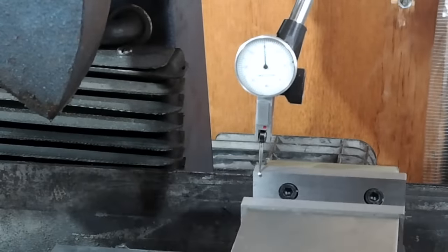I used a bit of junk aluminium — skip fodder — and while cutting it to length I also shortened the load lever. I very roughly cut clearance slots underneath it to clear the angled bed slides and prevent any damage. It's held in place using one 8mm bolt and an underplate. As you can see it wraps neatly around the front of the lathe head. After cutting another bit of aluminium bin waste and bending a bit of 8mm bar, I drilled and tapped various places to get the items to fit together, with the purpose of making the whole thing fully adjustable without interfering with any other controls — the closest of which is the lathe motor speed controller.